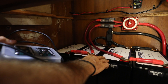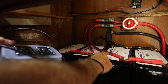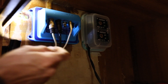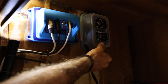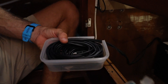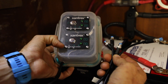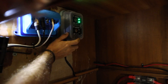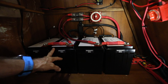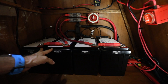Since the on/off switches for at least two of these batteries are covered up by the DC negative cables, we're going to install the remote on/off cables up on this side wall in our very handy fancy Tupperware container. Each one has a simple four-pin connector that connects right to the top of the batteries, enabling us to remotely turn the batteries on and off as well as see when they're charging or discharging. Everything's wired, everything's torqued down, and we're ready to turn these batteries on.